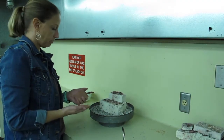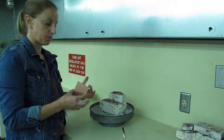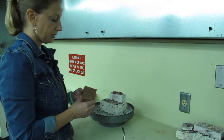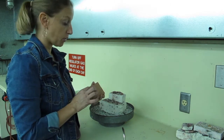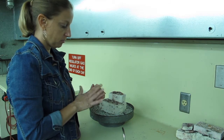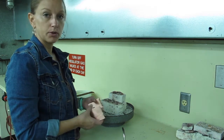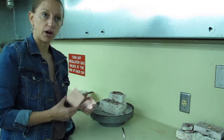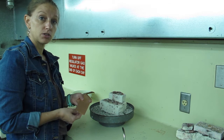When you get your metal from a manufacturer, it's been put through rollers and refined. It is what we refer to as work hardened — that is when the crystalline structure has been broken up into smaller segments and now it's harder to work with. We need this to be really soft in order to press our pattern into it.